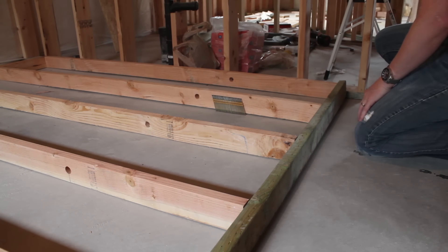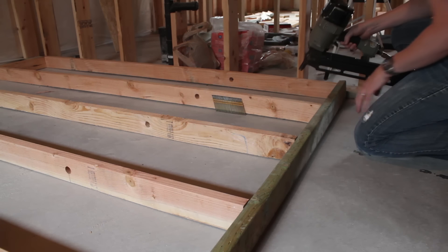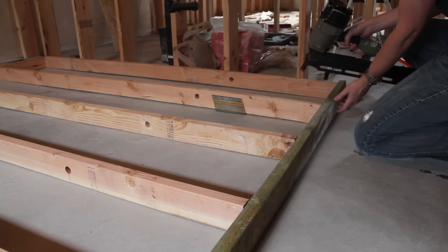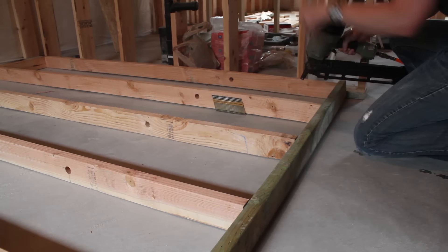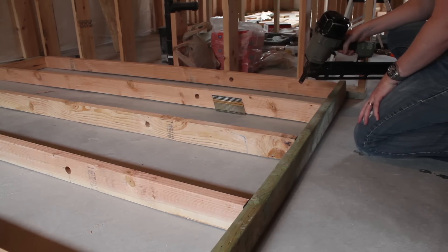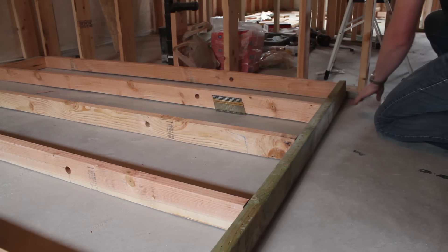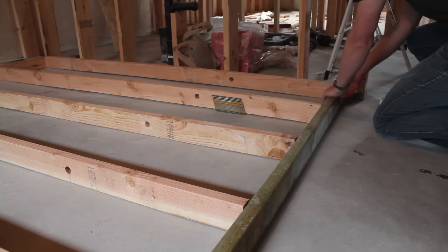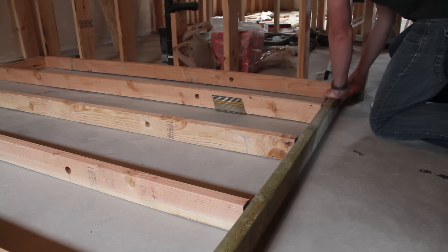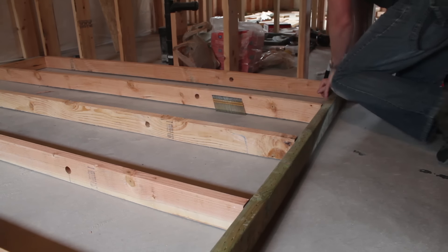Now for this next part, we're going to use our framing nailer to tack in two nails — one toward the top, one toward the bottom of each stud — going right through the bottom plate, and do the same thing on the other side going right through the top plate. Just make a nice pattern all the way down the row. Also make sure to line things up — this green plate is a little bit bowed up, so I'm just going to push it down a little bit to make sure it is as level as possible with the stud I'm connecting it to.